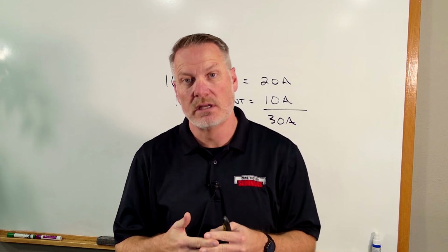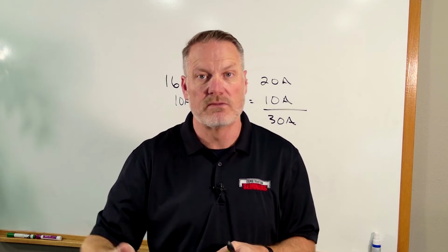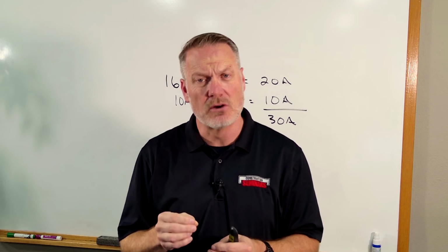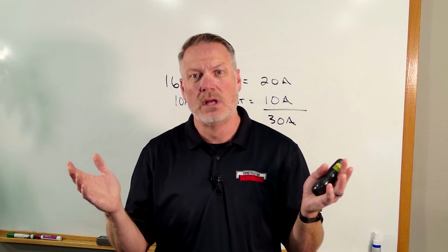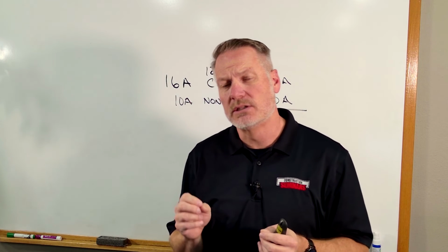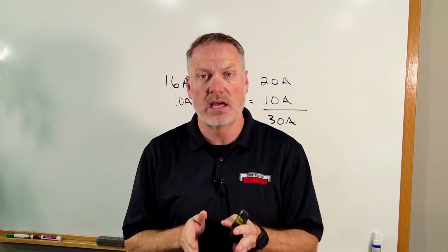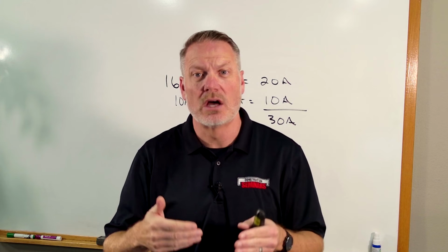Sometimes the rules are different. Sometimes it's 125%, sometimes it's 100%, sometimes it's 140%, sometimes it's 115%. We just need to see what that component of the electrical system is and go find what the rules are. When we start applying rules as a blanket rule, that's when we get in trouble on the exam. So don't do that. What you want to do is learn the rule from that section and apply it only in that circumstance. And that circumstance in this instance is for us to size our conductors on the branch circuit.